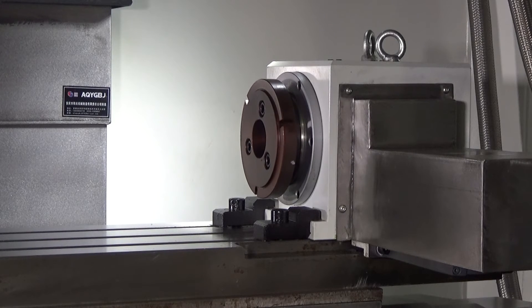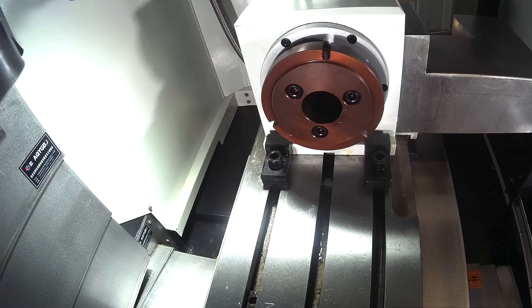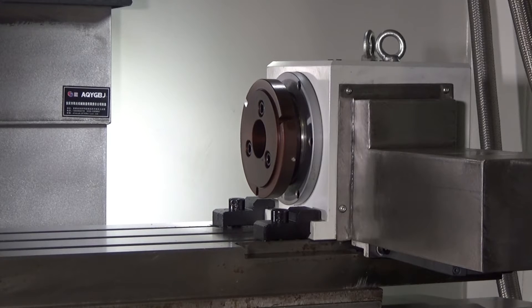In this particular table, if you listen closely, you'll hear a pneumatic blow of air. This one has a pneumatic brake on it that's also controlled by M-codes — standard clamp/unclamp is M10 and M11. The cycle you're seeing is just rotating 45 degrees.